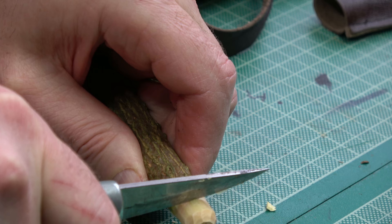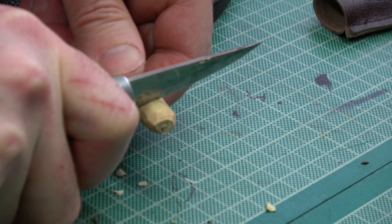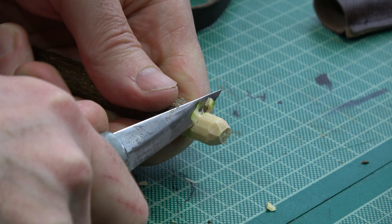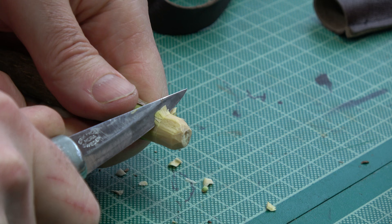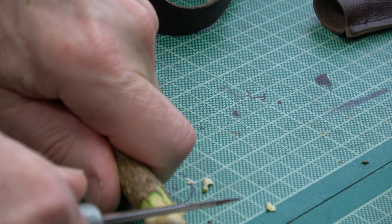The next step is to just hold your knife and turn the wood around - you'll get a marking score line that gives you a cut line to work to. Then do a row of cuts going round. Bear in mind that these knives are very sharp and therefore potentially quite dangerous, so do take care. Where feasible, cut away from yourself and watch that sharp pointy tip - some people grind the tips off. Once you've done that, you can then cut the other way.